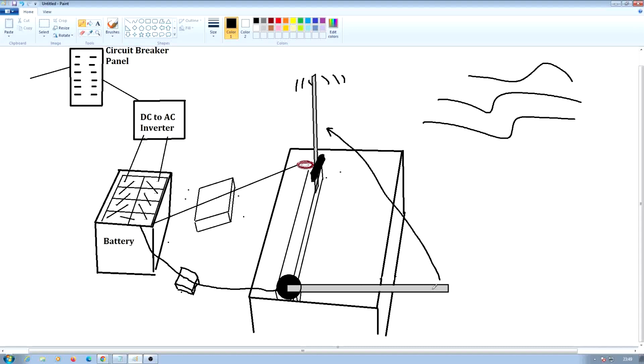When this mechanical arm hits this pole and the switch, as soon as it hits the switch, for it to reverse the motor to go back, to rotate backwards, and then have a switch maybe here, when this mechanical arm hits this switch, to open the circuit, right? And then the timer starts again, maybe 30 seconds.